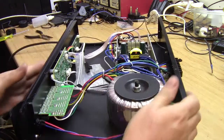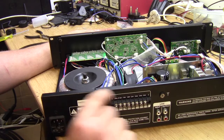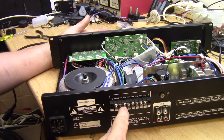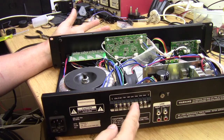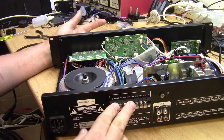If we look on the back, we've got our mains input, our common and 8 to 16 ohm output for normal speakers, then the 70 volts and 100 volts line outputs for distributed audio with a long run of cable and quite a few speakers on the line with transformers. These are channels 1, 2, 3, 4 so you can have separate level sets, but this customer just uses the common and 100 volts outputs.